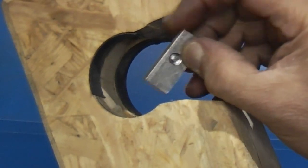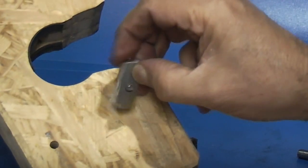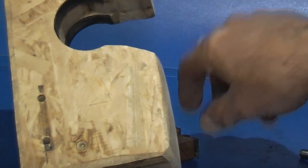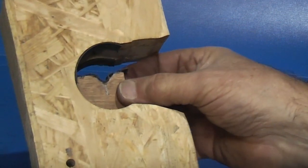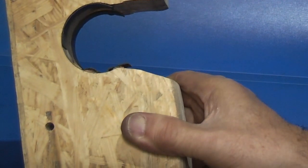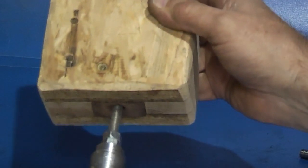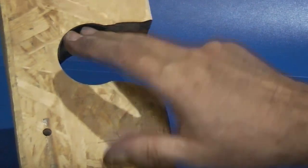What I've added is a piece of aluminium, and all that does is stop the head of the bolt pushing into the wood. Also inside here is another piece of steel that goes across, about the same size, with a thread in it. So the thread comes down to the top of this block of wood. What happens when you tighten this screw is it pushes the thread up and pushes that inside block up to grip the pipe. So this just adjusts the grip on the pipe — it's similar to a V block touching a circle on the back to grip it.